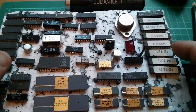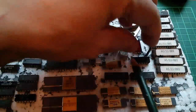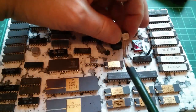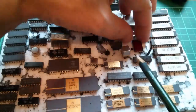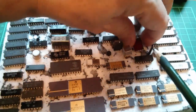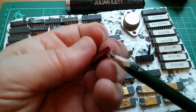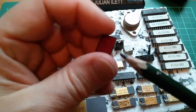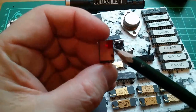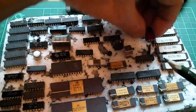We've got a few other bits and pieces on here, including some of these sort of tall tin can things — which are just relays. There's a rather nice seven-segment display with an integral driver chip here. This one is an 8-pin Hewlett-Packard device, so it has both the LEDs and the decoder driver chip in there.